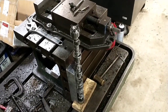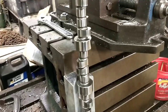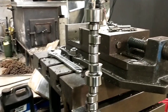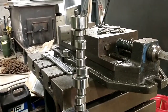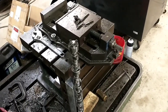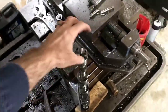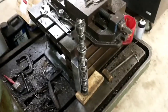Good morning everybody. We got a new project - got a call on yesterday. This is a camshaft out of a very custom high-performance Chevy big block, but there's very little Chevy actually about it. The block is a custom aftermarket block; few internal components are all that's actually Chevy. It's a high-performance roller cam in a twin-engine salt flats racing rig aiming to set some world land speed records. The issue is they had an oil leak, tore it down to chase it, and discovered their cam sprocket was in the process of coming off and had sheared off this hardened dowel pin.